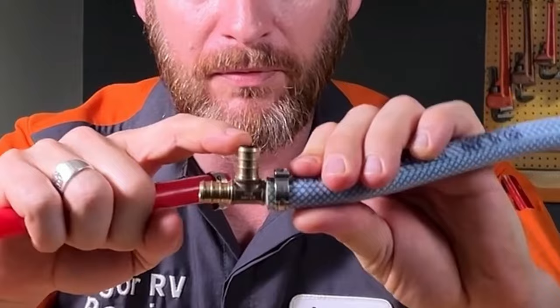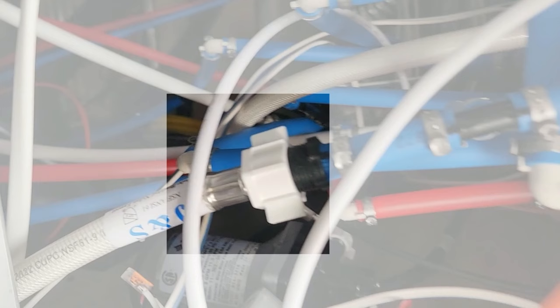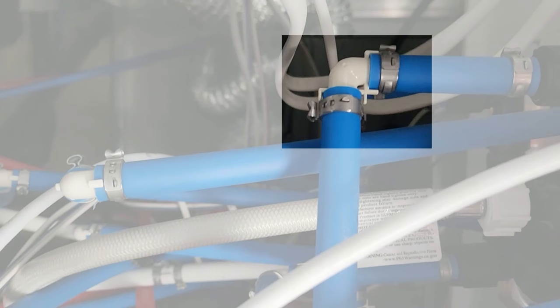And I know what you're thinking — don't RVs come with correct plumbing? Unfortunately, not always. This flexible tubing is not designed for this type of fitting; it should only be used with rigid PEX tubing. Alliance RV was plumbing their RVs incorrectly, but they got user feedback saying it was creating leaks. Since 2021 all Alliance RVs are plumbed correctly — 10 out of 10 for Alliance.